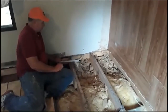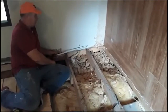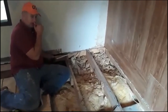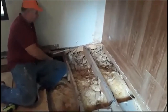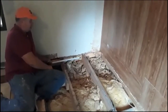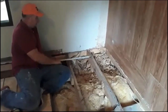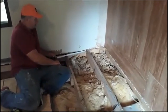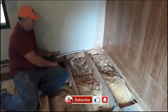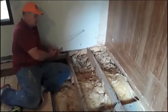This is what you're going to run into in all your mobile homes. You're going to end up with a floor joist that goes out and underneath the wall, which is not much more — sometimes just a little bit bigger than a one-by-four for framing. It is an inch and a quarter and usually not more than two and a half inches wide. Usually the bottom framing of the floor is one-by-two or one-by-two-and-a-half. They don't use a full two-by.